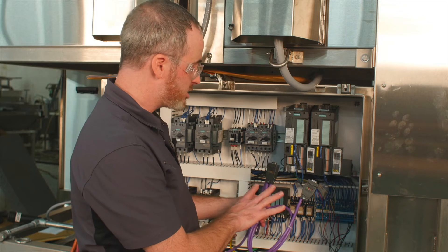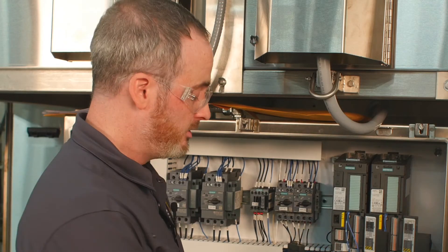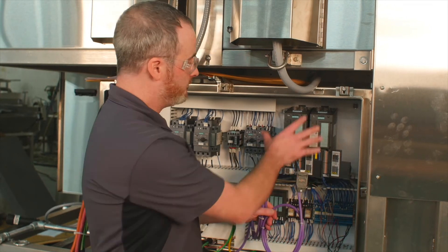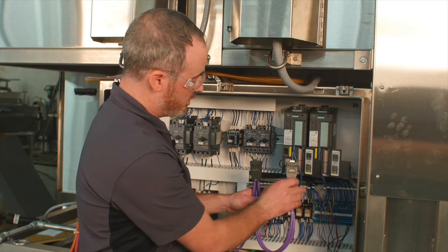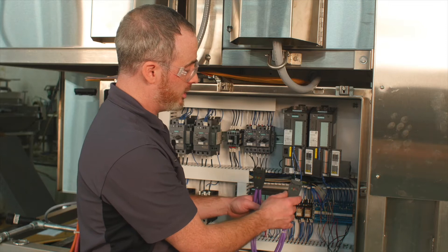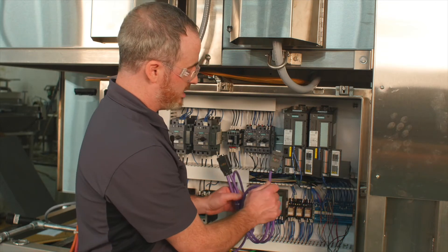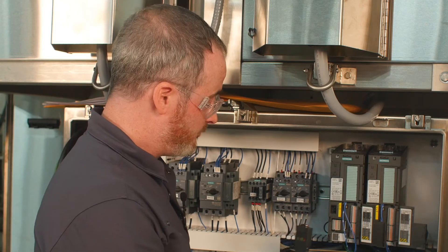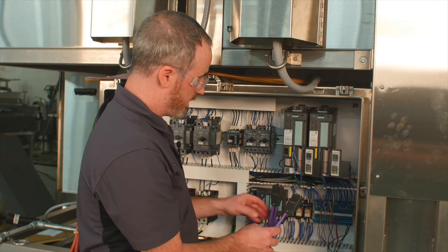Utilize the existing PROFIBUS cables within the system. If you have questions about connections, terminology, or resistors, refer to your electrical schematics provided with the control panels — if you don't have those, request a copy. PROFIBUS is the lifeline of communication between the controller and the VFDs; they won't work if not connected properly. Notice the red on/off switch — that's the termination resistor. Rule of thumb: if it has two cables, turn it off; if it only has one cable, turn it on. Make sure the PROFIBUS cable is tight and connected with no issues, as it can cause startup problems.